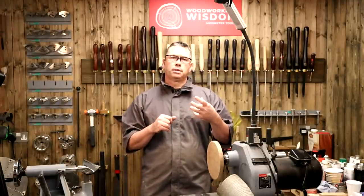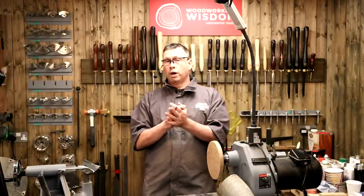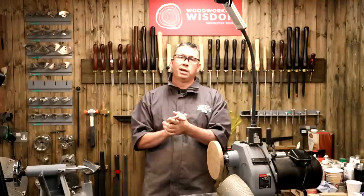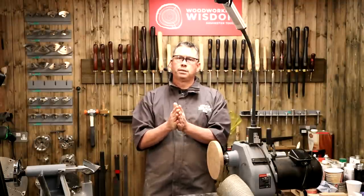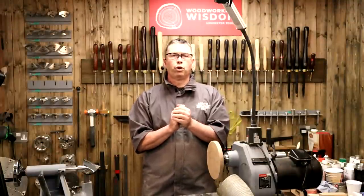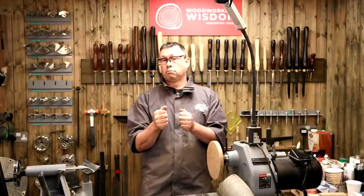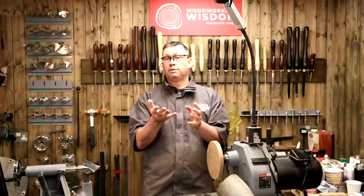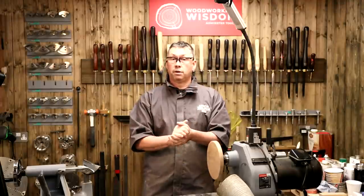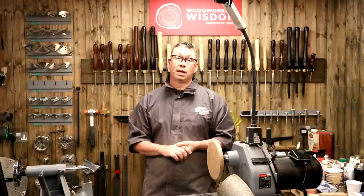So drying, to be able to handle it or to be able to recoat with melamine, should be quite quick. But curing generally is a matter of a couple of weeks in most cases. So I would say you need to give it plenty of time before you use burnishing cream. Burnishing cream or, like we've just discussed, cut and polish. Anything like that will just lift it a little bit. But it shouldn't take it off, certainly, and especially with 3 coats, definitely not. If you're getting any problems with that, again, contact manufacturers just to see if they can give you any pointers.